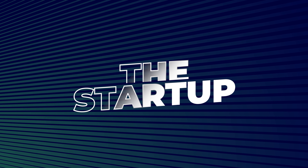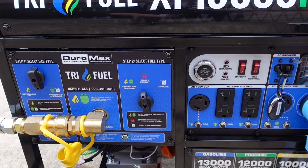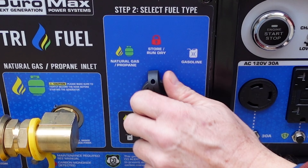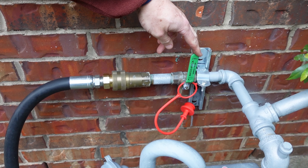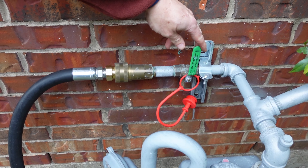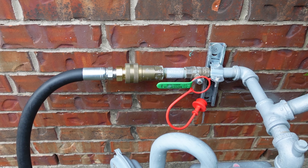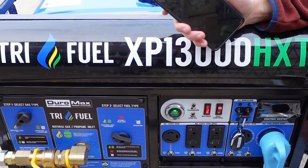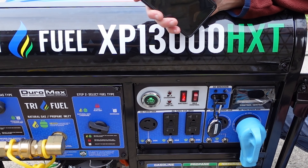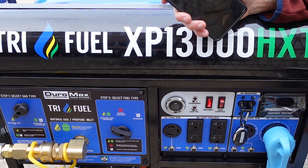After the setup it's a good idea to test your new generator, so that's just what we did. First up we took the natural gas hose and hooked it up to our generator. Notice this knob — it allows you to switch between your fuel sources, so we set it to natural gas. Plug your natural gas hose into your natural gas source. In this case we had ours professionally installed with a valve allowing us to turn the gas off and on at the source. One thing to note: depending on how long your hose is, you will need to bleed the hose of air and fill it with natural gas before the generator will even start up. We manually tried to start the generator about three times to fill the gas hose up, and after this it started with ease.